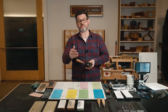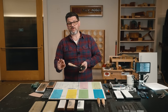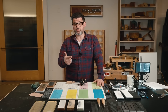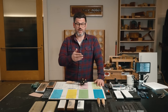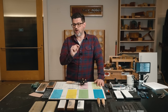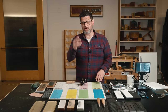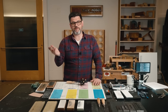Each system was tested the same way — same number of strokes. We tested a lot of different things. The first was 25-degree bevel versus 30-degree bevel. Typically people say to do a 30-degree micro bevel because it makes sharpening easier — you just need to take off the very tip. At 25 degrees, you have to do a lot more work. Both came to about 180 grams on the scale. Since 140 is the baseline, 180 is a decent start — but the result was the same for 25 and 30. There is no difference.